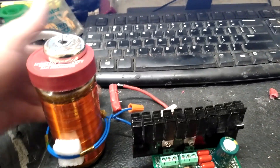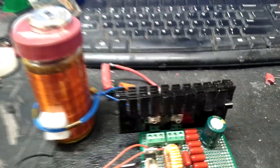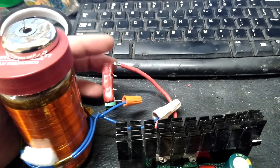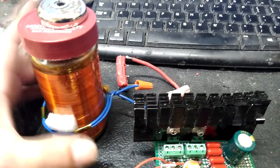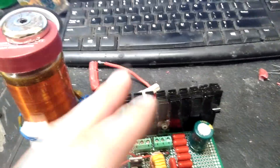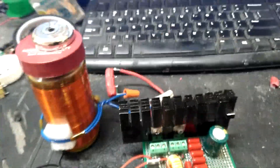I opted for this because I could bump it all the way up to 24 volts to get the beefier output, since with the 25 nanofarad tuning I couldn't crank it really too high above 20 volts and the output was more appealing with this arrangement. I was thinking what I might do in the end is add another cap on here and make it switchable from 33 to 25 nanofarads, make the primary easily adjustable, and then if you wanted — just for novelty's sake — run it at six, nine, or twelve volts to get impressive output. That's pretty cool.